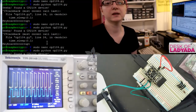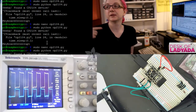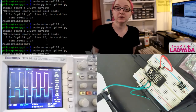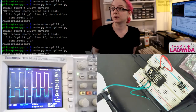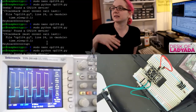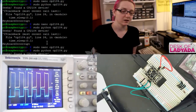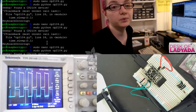I wonder if there's something that is delaying a millisecond per transaction or something. Oh, you know what? That's probably it. There's probably a millisecond per transaction, so it can't toggle faster than that. Well, 1 kilohertz isn't too bad. If you wanted to bit bang something, it's fast enough to PWM, to control something over SPI, or if you want to turn an LED on and off very fast, you could do that as well. But probably fake some PWMing if you really needed to. You'd have to be running these requests constantly, but it looks like they pretty much just run.